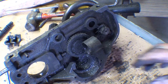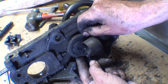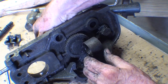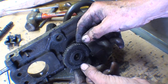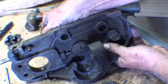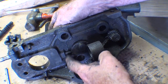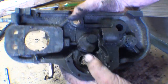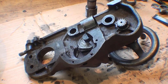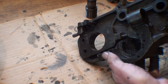I just had my favorite eight-foot fluorescent light bulb burn out so it's kind of dark. I couldn't figure out how to get this gear off because there doesn't seem to be any way to do that - there's interference with this part of the casting. So I'm fiddling around with the feed change lever, and I got this thing upside down. Next thing you know, it literally drops off. This is operated by the feed change lever, and this is the lockout here - so you cannot use the half nut lever except when this is in the middle position. It's a lockout. This is a very intricate casting - look at the way this piece stands out here all by itself, and it's all one piece. Must have been some pretty fancy core work there.